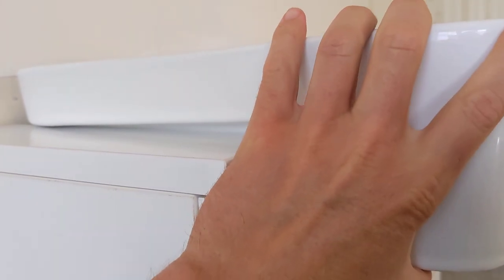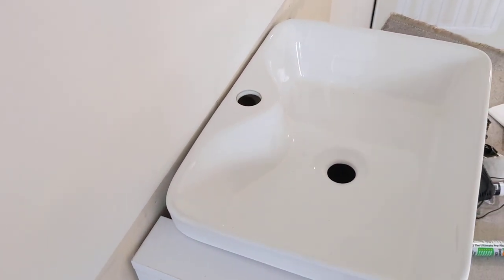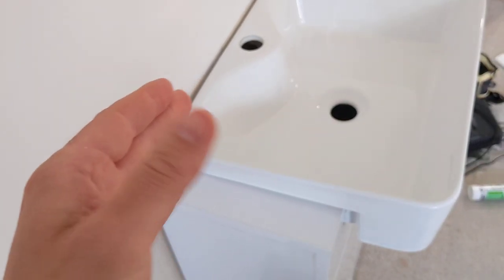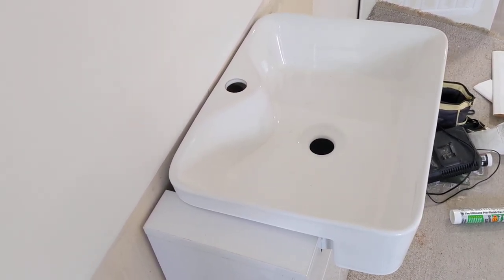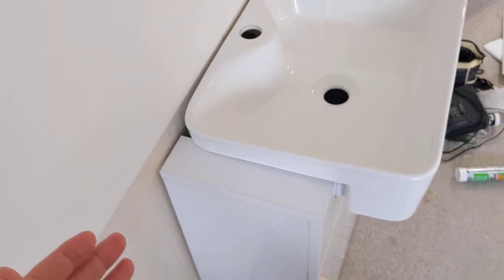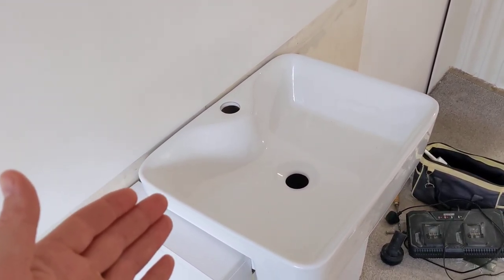My sink's now tilted backwards and it's not secure - I can't really work this out. It must be wrong, because this should sit flat against the wall and flat against the tiles so that it looks nice, but it doesn't. So either the vanity is too short, or the basin is too large, or there's too much of a curve in this basin. It doesn't work, and I can't fit it as it is - it's probably going in the skip, which is a massive waste considering how expensive it was. I'm hoping one of these two is faulty and you can do something about it.